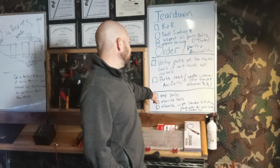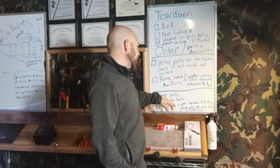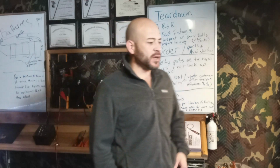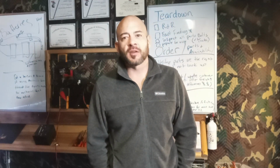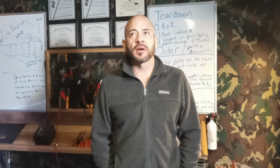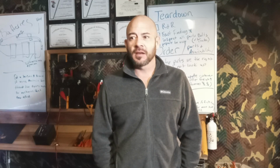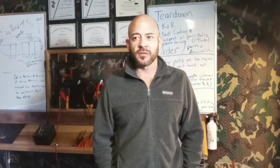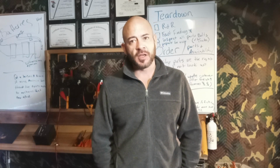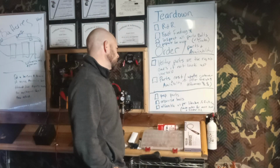So then we prep our parts, and we organize our tools, and we assemble. Ask for the literature for the first time and make notes that you will put into a folder. The reason why I say make notes is that you don't have to pull a book out every time. But if you made notes, then you can also track that specs will change, like backlash and all these other internal engine specifications for thrust, for a crank or whatever. Make sure you're up to date with the specs because they often change. I've discussed that in one of these other videos with an ISX and the gear train.